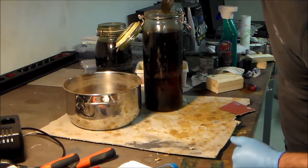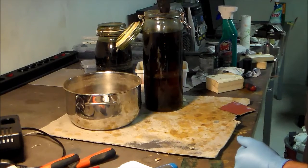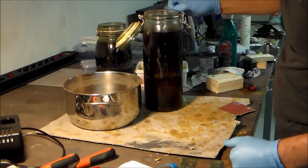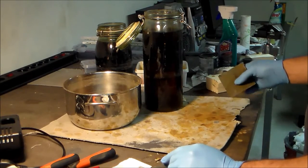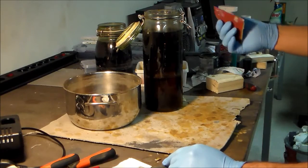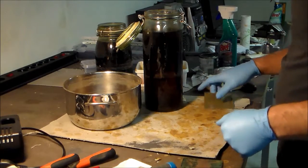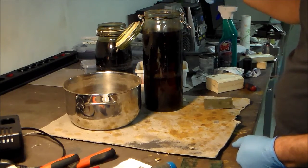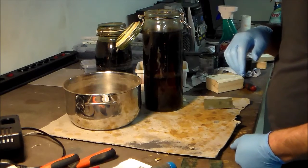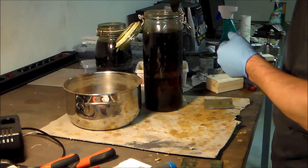Oh yes. Oh, this is nice. I'll leave it in for just a few more seconds, so then I'll take it out. I have some 600 grit sandpaper that I use to rub it clean, and then it's coming back, because the first time I put it in the etch, there's some stains from my fingers and water droplets and various kinds of things. And after the first etching, you probably still see this.